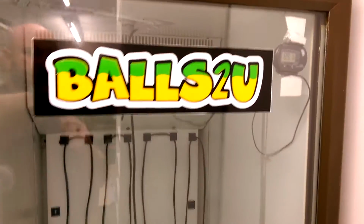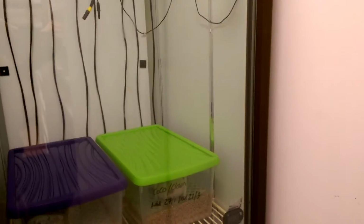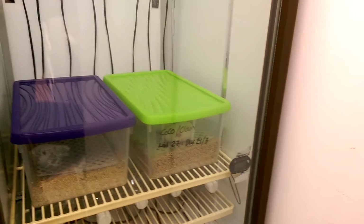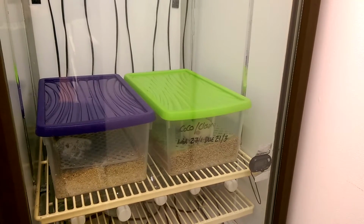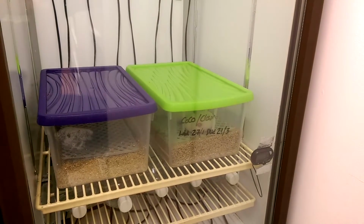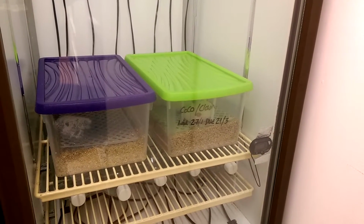Okay. I went on eBay and bought some digital thermometers. As you can see there, I put one at the top, one in the middle, and one at the bottom. The reason why I've done that is that digital thermometers can vary in specification. Some of them work really well, some of them can be all over the place, but I tried to get three of the same make so that they weren't going to be too far out. Again guys, they're only there as a guideline, not as an accurate reading. They're just there to give you a fair idea of what's going on inside the incubator.